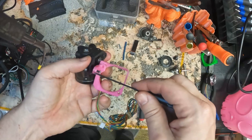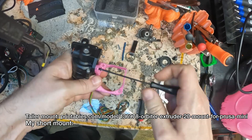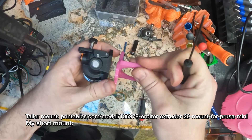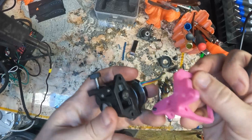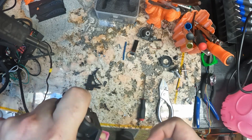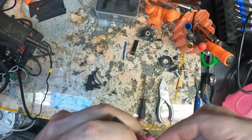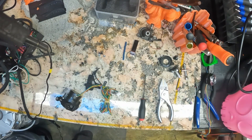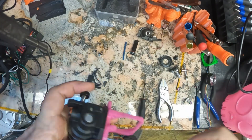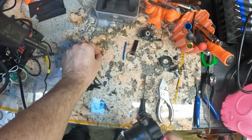I want to get the filament path as short as possible. There's another mount posted on Prusa Printers - I'll send the link below - that increases the size enough that the motor can be mounted backwards. I don't think it makes a huge deal but the whole point is TPU, so I want to maximize my chance of success. Also make sure your holes are actually lined up; if you put this mount on backwards it simply won't go on.